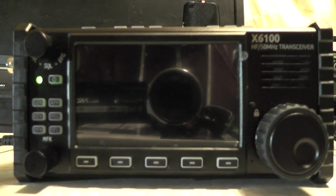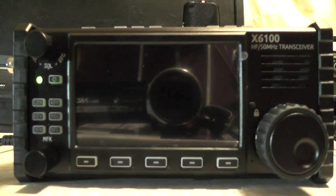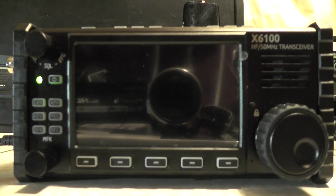The software I downloaded was from the 2nd of November. To update the firmware or software in this radio, do exactly the same as you would in my black screen of death video. Download the firmware, flash it to an SD card or micro SD card, insert it in the radio, make sure it's powered from the mains or a 12-volt supply, turn the radio on and let it update itself. The update doesn't remove anything — if you've widebanded it, it won't remove that, and any channel info or stored settings will come back as normal.